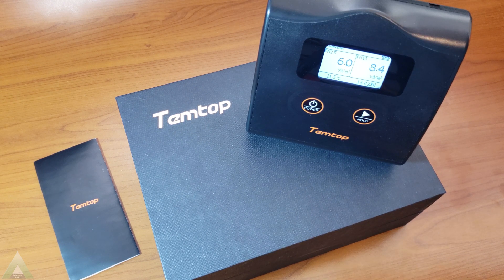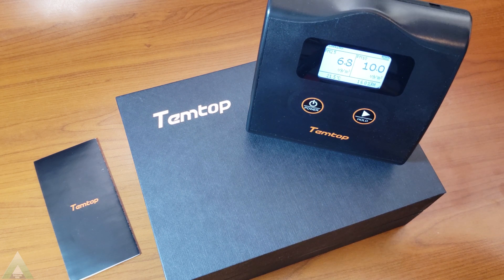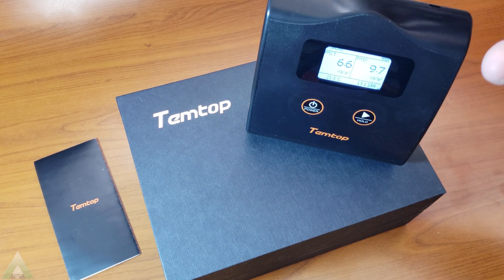The biggest emphasis is on that 2.5 aspect. At the PM 10 level, your body is actually able to expel those particulates — you can sneeze or cough, and that's the reason your body does that. When it comes to PM 2.5 and smaller particles, they're much harder to remove from the body because they get into your lungs and can cause more irritation, especially for those who are more sensitive. So I'll be concentrating on that PM 2.5 number more specifically.